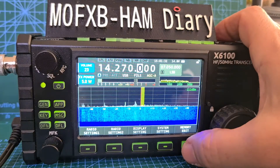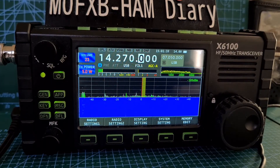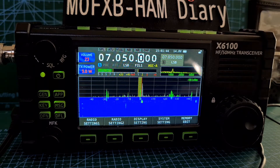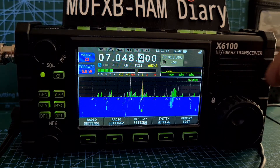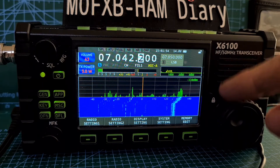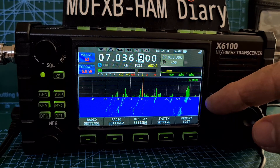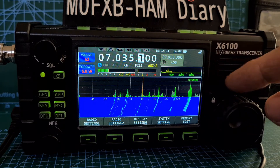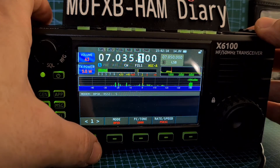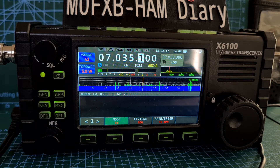I tend to be happy when it comes on and you can see some activity. As I said, it's a bit glitchy at first. Now we're going to hit System, go to Firmware Upgrade, and hit Upgrade. Sometimes this fails — if it does, just reboot and do it again. Okay, that looks good. Let's dim it a bit and give it a test. The main thing we didn't have anymore was the CW decode, so we'll go down into CW mode. App modem: CW, speed 20.